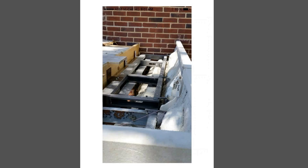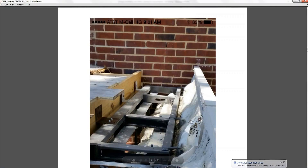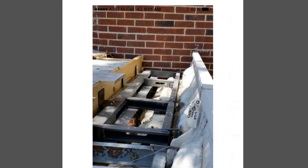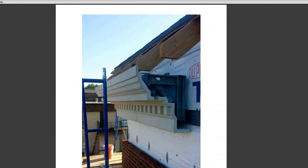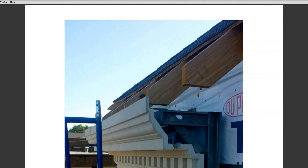Looking down on top of the panel, on top of the GFRC cornice, here's the frame. You can't really see the bearing angle, but you can definitely see the attachments. They haven't completed this attachment just yet, but you can see where it's screwed into the frame after they get it aligned and level - they would screw that right into this header attachment. Zooming in a bit, you can clearly see the GFRC cornice and that bent plate attachment screwed into the top and back into the wall.